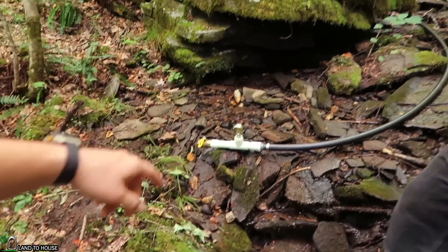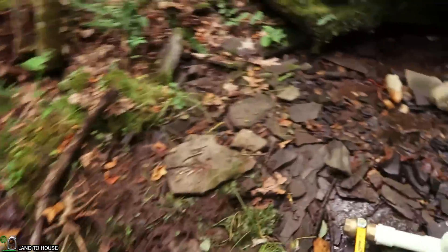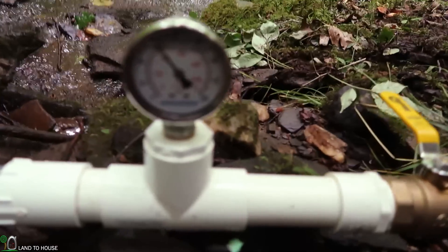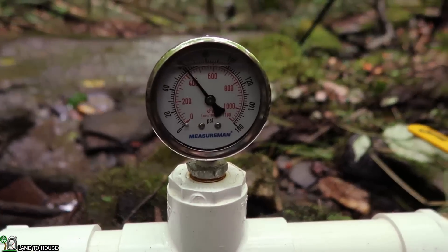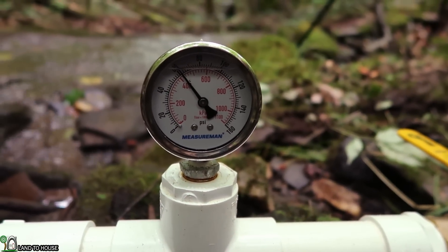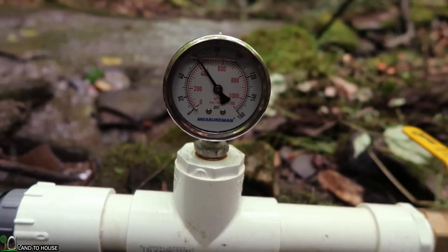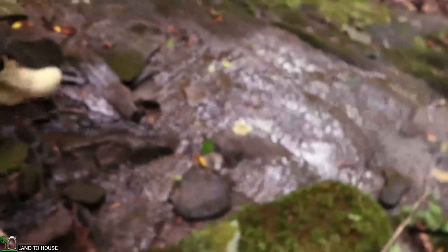Today is exciting. We're going to be installing the turbine from Langston Alternative Power. In the last video, we ran the penstock down to this point here and we let it sit for an hour or two, and we wound up with around 62 psi for the static pressure. Now, when this thing gets going, it'll probably drop down a little bit for the dynamic pressure, but we're going to be using this area right here as our turbine location.